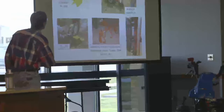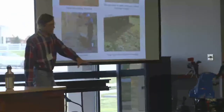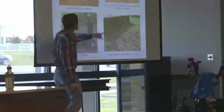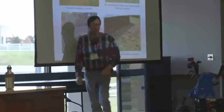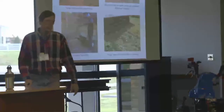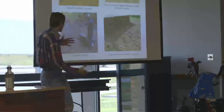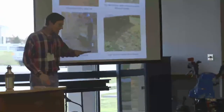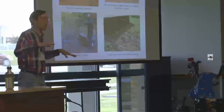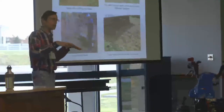Yep. And we even, the roller system on the power harrows was so popular that a roller was developed for the back of the tiller as well, for people who wanted that sort of precise depth control with the tiller. And there's two things that the roller does for you. One is obviously precise depth control. The other is just pressing the bed, making it perfectly flat and kind of firming it up, pressing a little of the air out of it.